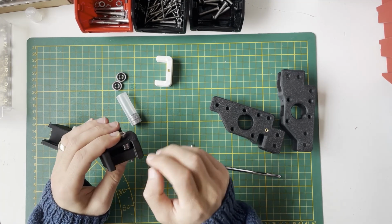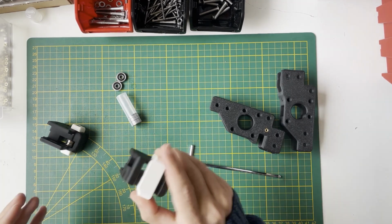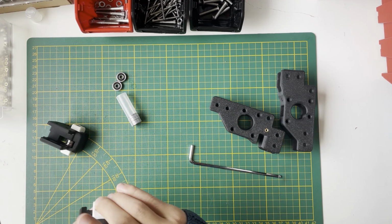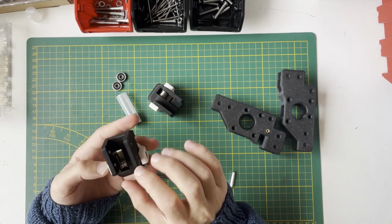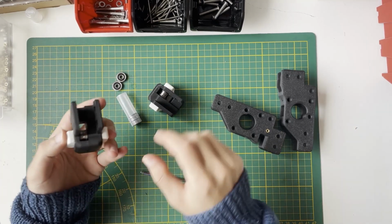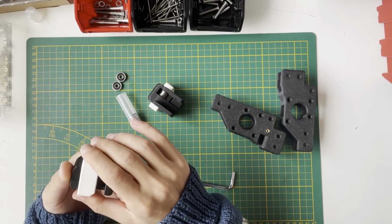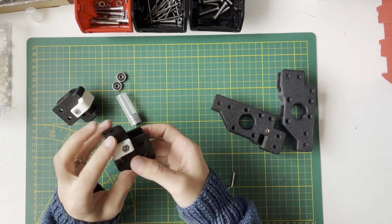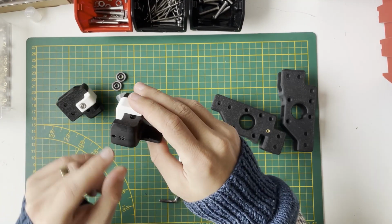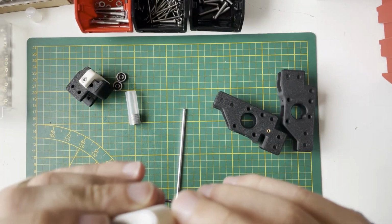This part is just to align the bearing stacks together. Check if something is dropping or not. Do not over tighten these screws because the bearings should move freely, and also your part should move relatively free. The flat surface needs to look at the Voron logo. Where you place the heated insert should look on the back.